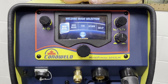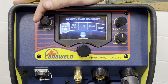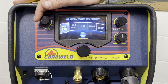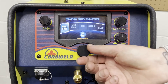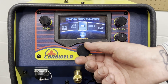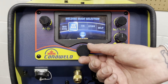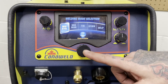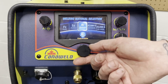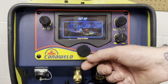So this is what you're going to see when you turn on the machine. MIG synergistic is what we're going to be doing today, but let's run through it quick. MIG synergistic is where it's going to ask you the questions and set up the machine for you. MIG manual is if you're an expert and you're going to set it up yourself. Here you've also got your TIG control settings, your stick settings, and then your help. So let's go back to MIG synergistic and see how easy this is — let's press the button to enter.